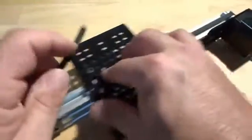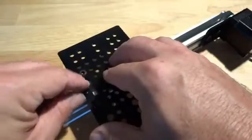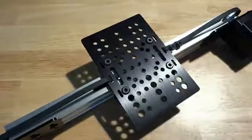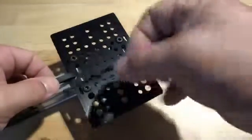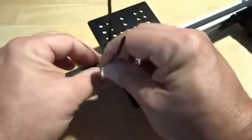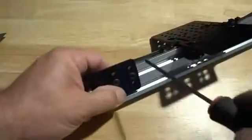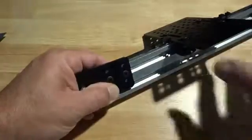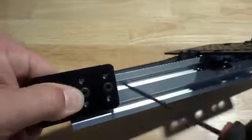We'll bring this through. It's a lot easier if you are pushing the plate in the direction that you want this belt to curl. And if you have a pair of needle nose, you can reach in there and grab them. There we go. Alright. Now you can see I'm still loose back here, and that's fine because we can adjust it. That looks good. Take this, loosen it up, and I'm going to pull it tight. I'm pushing over, grab the pulley, pull it tight.